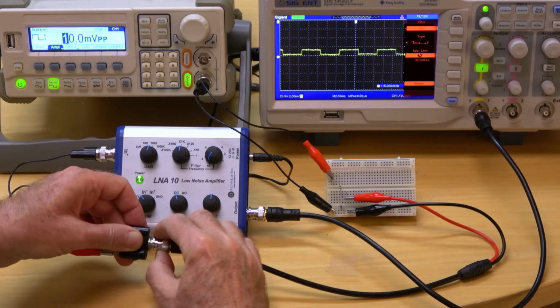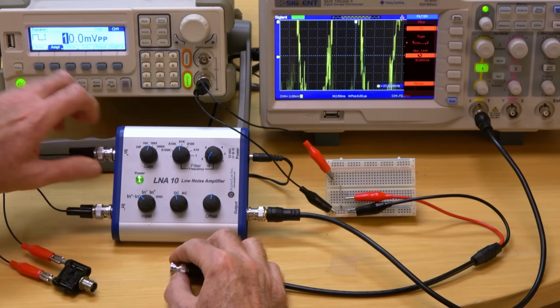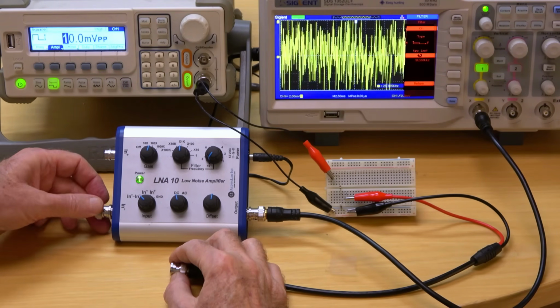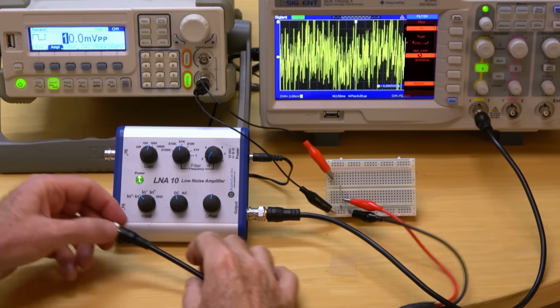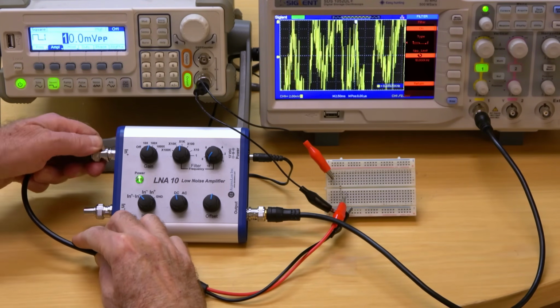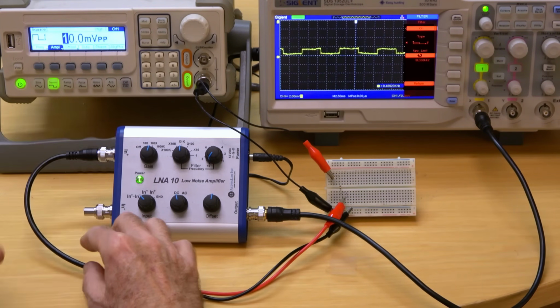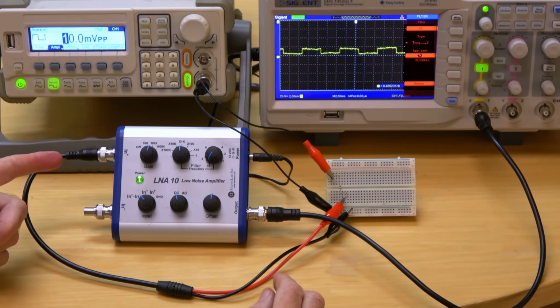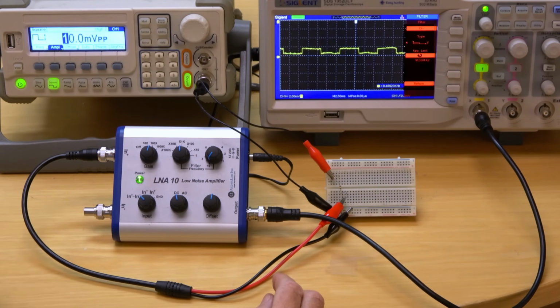There's another simpler way to connect a signal to a differential amplifier. Short circuit the negative input and connect the BNC with the full signal to the positive input. This means that the negative input is still amplifying the ground and subtracting it from the positive input. The output is not quite as clean this way, but it's easier to do quick connections to the amplifier.